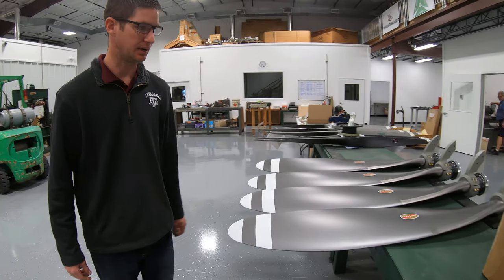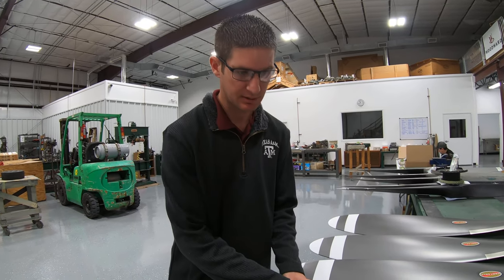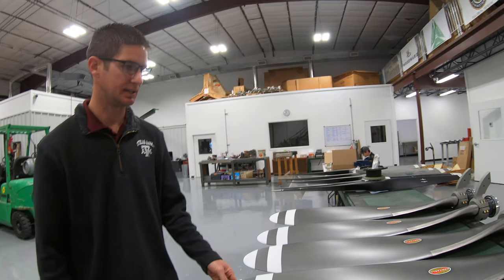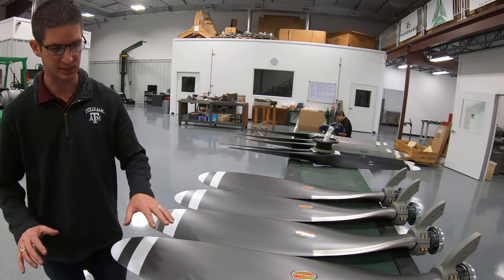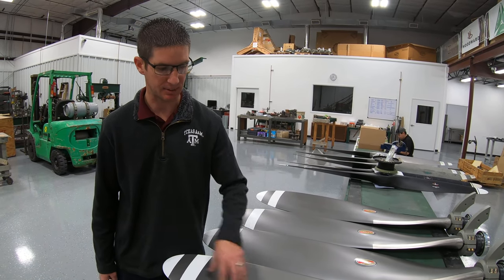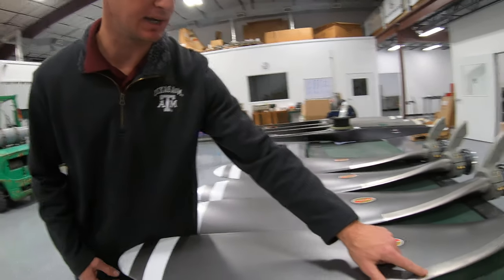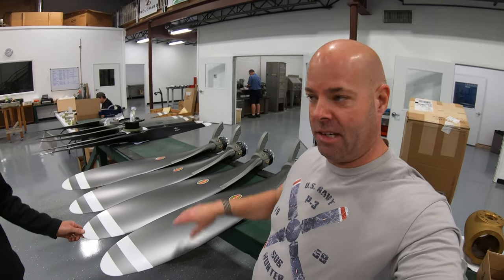Composite technology is also coming up in propellers — it's pretty much the wave of the future. These are some blades off of a 1900D, so they're actually composite, not your typical aluminum blade. We overhaul those as well. The process is somewhat similar but also pretty different. These counterweights are inspected, the blade is completely stripped through sanding, and any cracks or delamination is taken care of with new fiber, new fabric. Then it's painted with a static paint, all per the manual requirements. These leading edges, if they're damaged, have to be pulled and replaced. These blades are a little more expensive — if a prop costs you five or six grand, these blades are $28,000 a piece. So you want to be real careful with them.